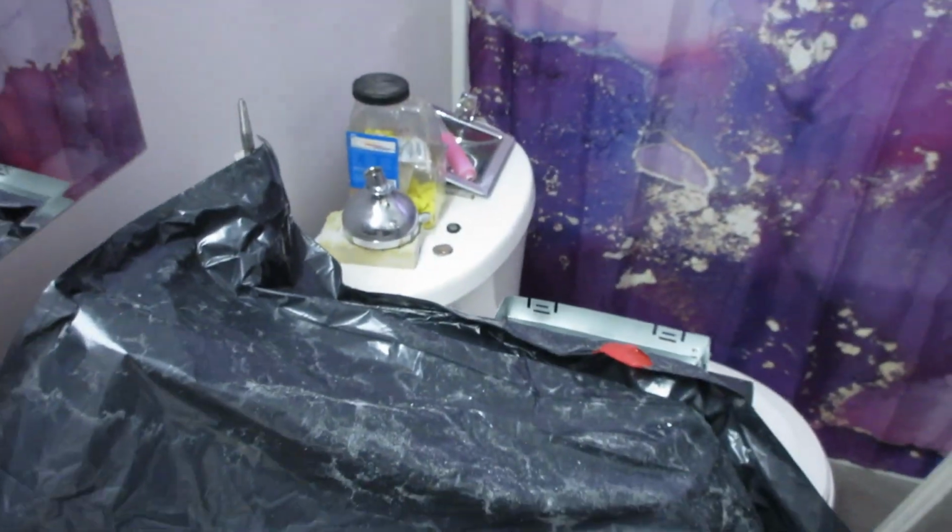Alright folks, so up in the attic I located where I'm gonna put it, and I put a screw right there. See, I put a screw going down so I know where the side of the rafter is at, and then from there into the bathroom. There's my screw sticking down, and it was 18¼ inches off the wall, so I made 18¼ inches off the wall and held up my fan kit, which is sitting here.